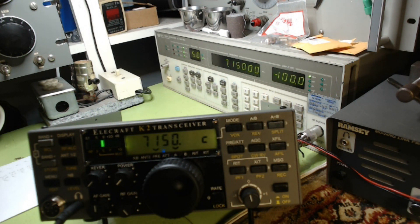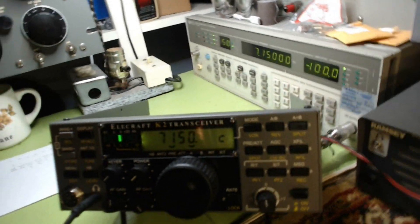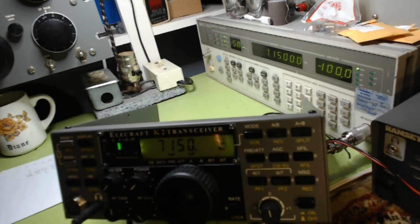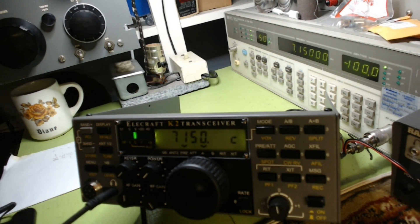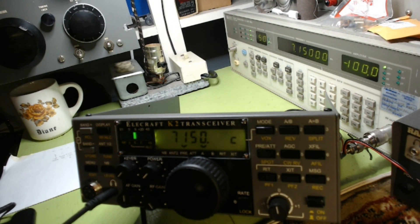Use a plastic tool to adjust L1 and L2 — they're both small little IF cans on the back — for peak signal strength. You may also be able to use the bar graph if the signal is strong enough. If you don't hear a signal, go to the troubleshooting section. I'm going to put the mic by the headphones, not totally in them but extremely close.